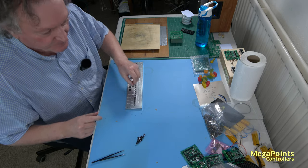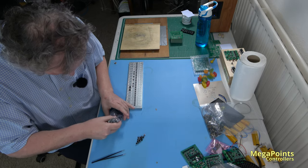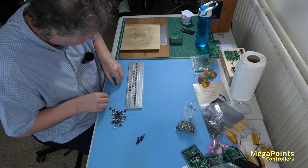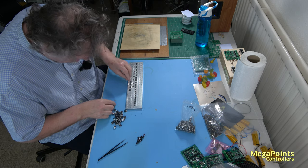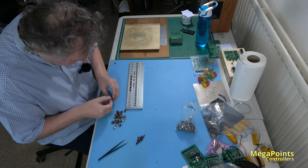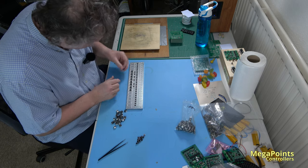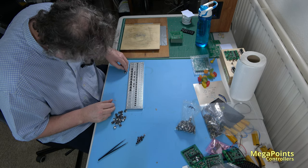At the bottom of the tray, I'll load the voltage regulators. Sure everything's happy there. Now this will take 16 across because the slot they're in is bigger than the MCU. So I'll put some additional ones at the bottom of the pick and place machine.